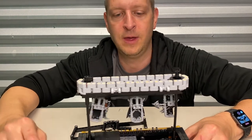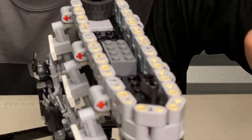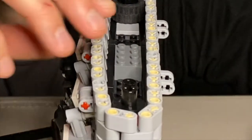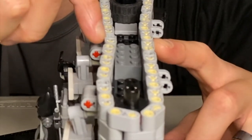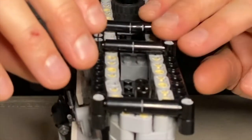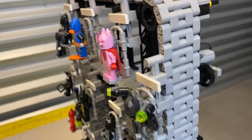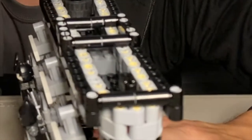What I noticed and got concerned about is that this chain, because of the weight of the Batsuits, tends to drift and bend over. You can see that the chain on this side is nice and straight where there aren't any Batsuits, and the chain over here drifts and bends. The reason is there's nothing holding it straight. On my other Batsuit conveyor the chain is vertical and you've got gravity working for you — here gravity is working against us because the Batsuits are pulling off the side of the chain. So this float is designed to pull back the suits and keep them from hanging too much.